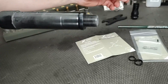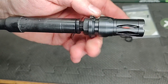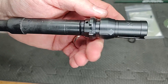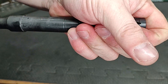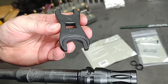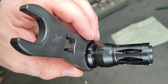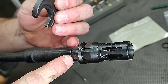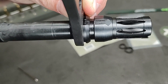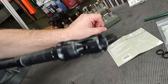So you put it on here, take your muzzle device, and you're going to get it within a certain number of degrees. I'm always a fan of using proper thread lockers here, and the right tools. This is a Forward Controls tool — I like these because they have very slim jaws and fit perfectly around the muzzle device without getting in the way of the shim. Put your torque wrench on here, torque at the value, and you're done.